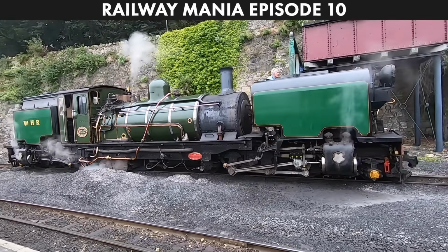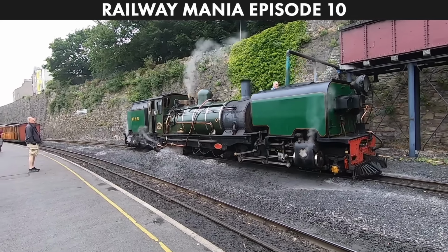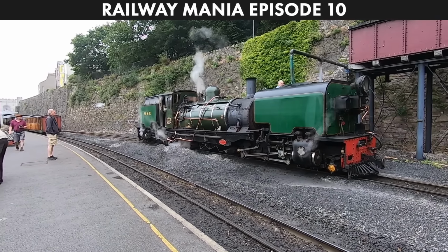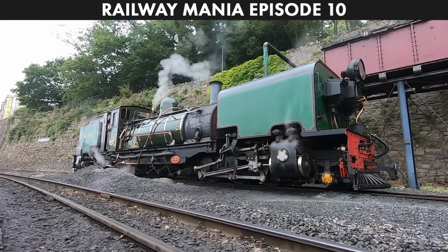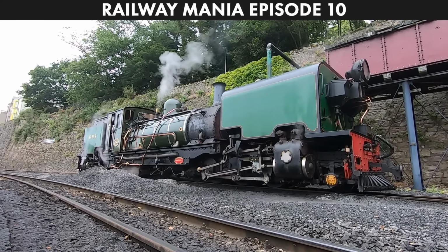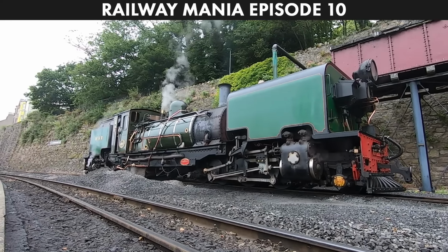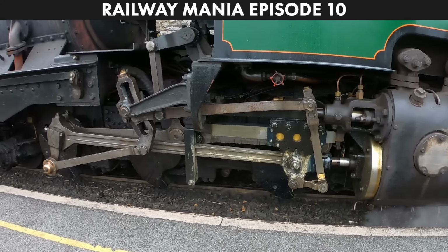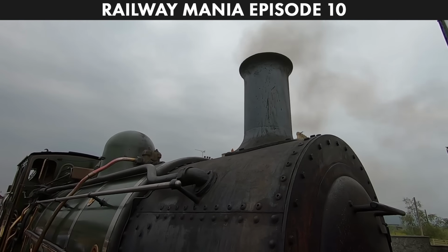Something else we've been doing is we've modified the South African design so we have a bit more adjustment in it, because it takes a while to set it up properly. The most important thing is getting the boiler unit set first, which most people wouldn't even consider doing because the reverse is in mid-gear and that's it. But because we have the 2 intermediate shafts on the NG16s, you have to set them to mid-gear first. And then you find mid-gear on the power bogies, and then you work it back to the boiler. Not very easy. Yeah, there's so many things to think about compared to a standard loco.